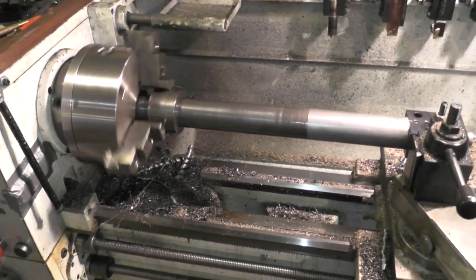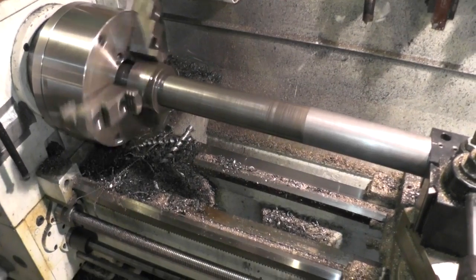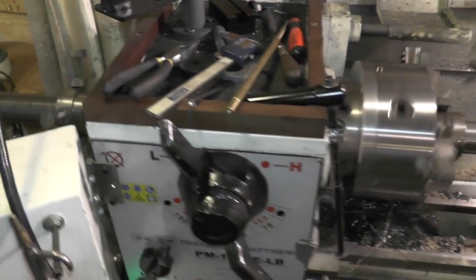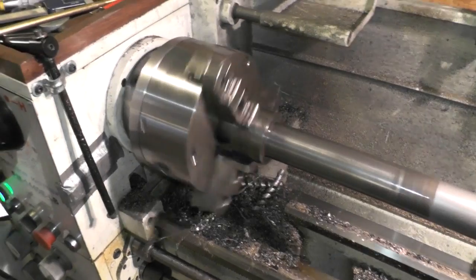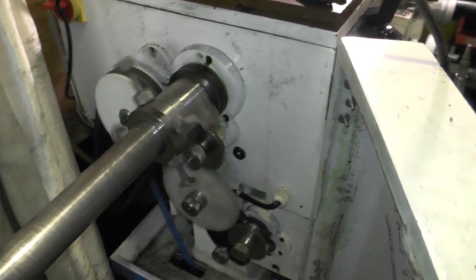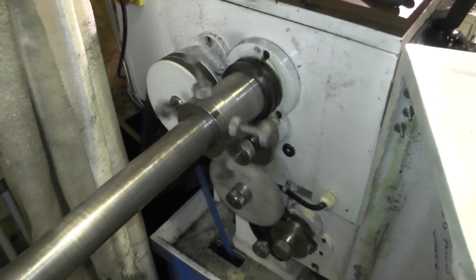How it's all working is that piece of stock you see right there, bolted into the boring bar holder — that's a piece of 1-7/8-inch cold rolled mild steel, roughly 5 foot long. You can see the other end sticking out over here. There was a cutter punched down through the center of it. On the back side here you can see the 4 adjusting screws spinning around — that's a threaded adapter centering piece, what people call a spider, that I used for miscellaneous projects.